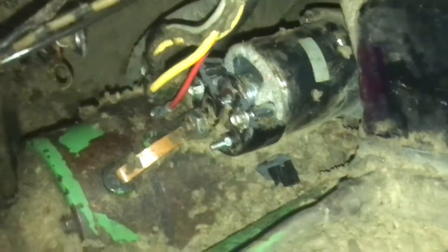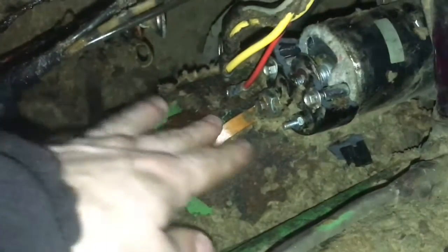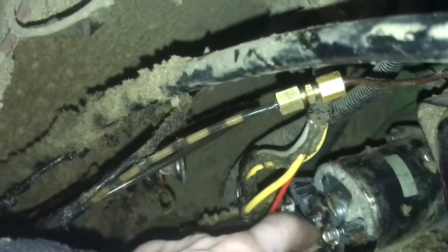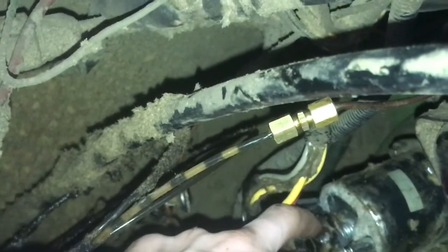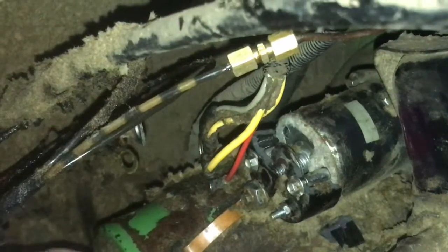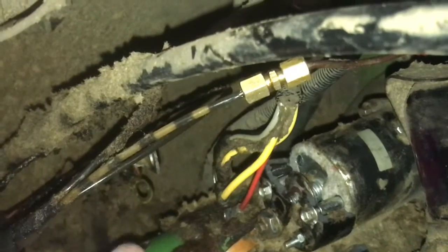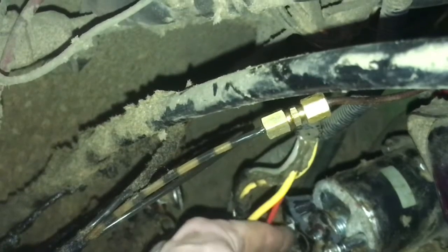Good morning everyone and welcome to another episode of Green Pastures Farms. Today we were going to try and get harvest done, but another problem happened. Down there is my solenoid — doesn't look good. It works with the starter, which is this green piece down here. I've been trying to take it off; I was beating on it with a hammer because that's how you do starters. This one decided to snap on me, so I'm going to have to get another solenoid. The starter has been rebuilt, so I don't think it's the starter — I think it's just the solenoid. Hopefully that's just the problem and we have no further incidents. Fingers crossed I can at least get this fixed today.